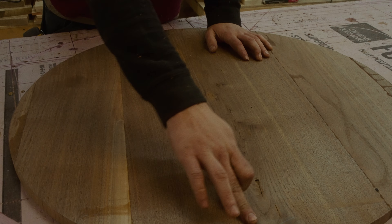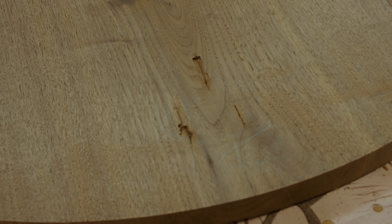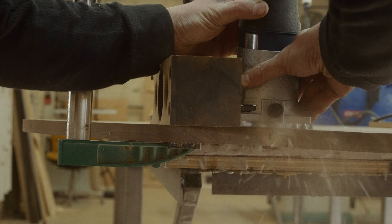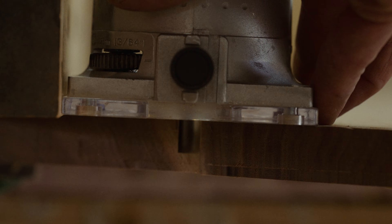With both circles cut out, I shifted my focus to filling in spots that were missing towards the edge of the circle with walnut scraps. I made a quarter-inch by quarter-inch sliver to fill in a missing spot on the table. Taking a piece of scrap wood from the same build and adding it back to the same piece just feels like welding to me, but with wood. This hole was too big for wood filler, so the better option was to fill it with an actual piece of wood.